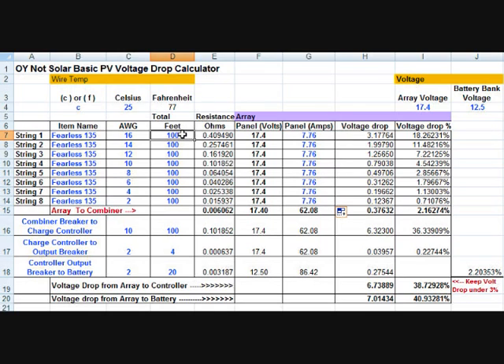Maybe I could get away with 80 feet of wire — which is 40 feet away — and see if I can use 10 gauge wire. But I'm still over 3% on 10 gauge at 80 feet. Let's try 70 feet — still not there. So I'm going to have to go to about 65 feet if I want to stick with 10 gauge wire to finally get under the 3% voltage drop for that distance, but obviously my distance is getting short.